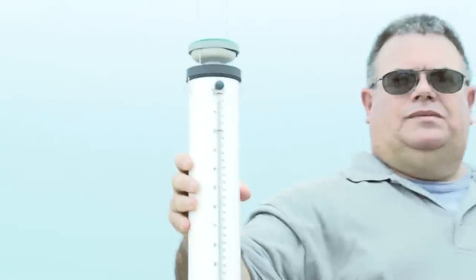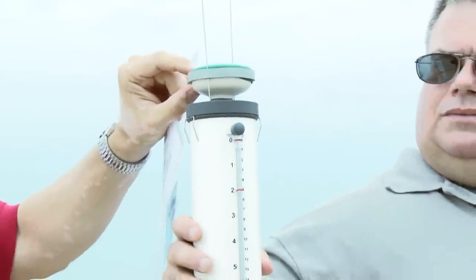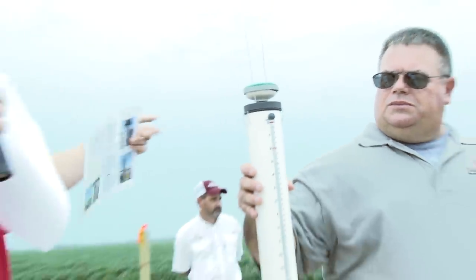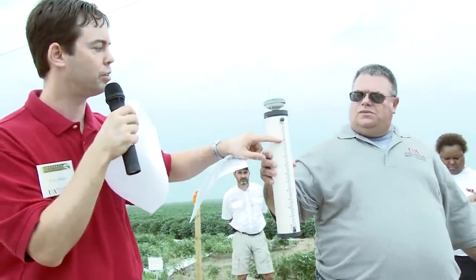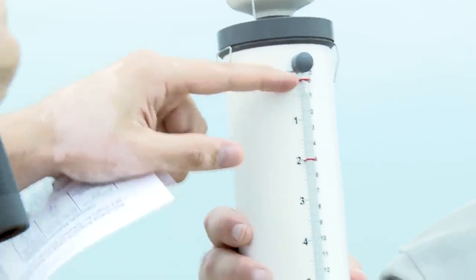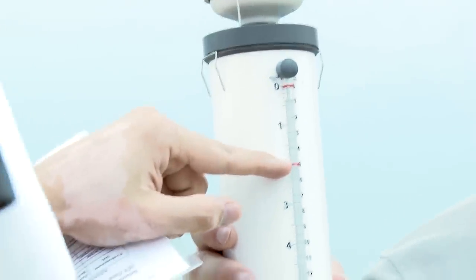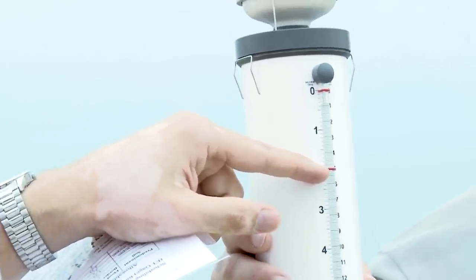And these basically have to have a canvas and ceramic plate on top, and this has been developed to mimic the evapotranspiration from the leaf surface. So this is experiencing the same ET that the plant is. So that's basically what it's doing. So here we started it after we irrigated last, and it's full, and we haven't had a lot of ET. And when the liquid level gets to this mark, that's our trigger point for irrigation.